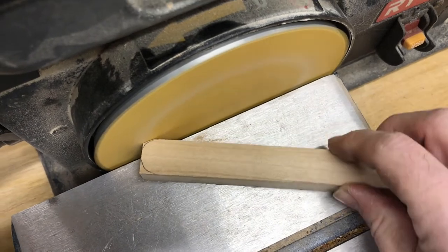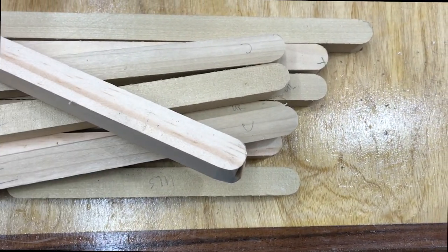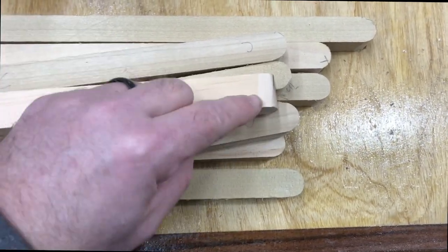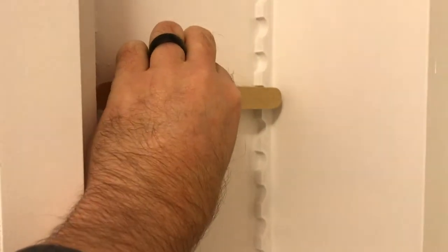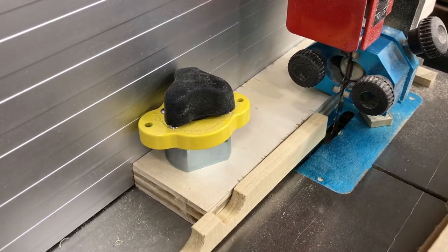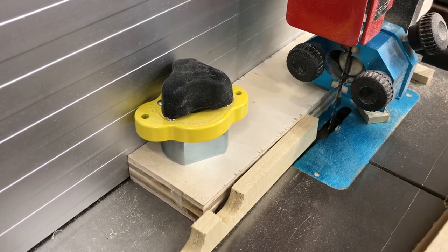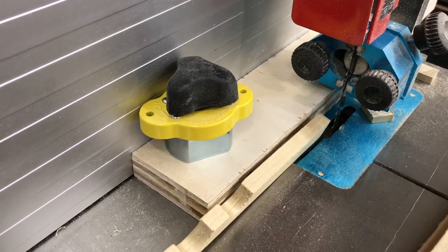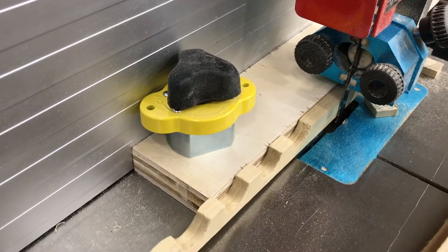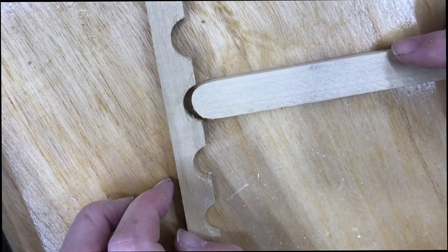The stiles are cut to size and rounded over to fit the adjustment brackets. I've got all the stretcher braces cut to length. I set up the bandsaw jig to cut the rails the same width as the adjustable pieces in the cabinets. I could do this on the table saw, but the bandsaw gives me the exact same width, and if done correctly everything fits together perfectly.